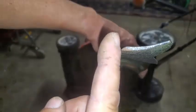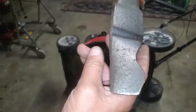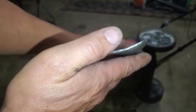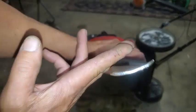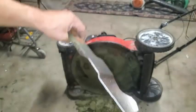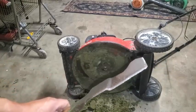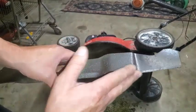You want to try to maintain that angle, seeing it going from this direction. A good thing to do is to flatten it out first — flatten it all the way out to the end of the bevel, just flatten it all the way out until it's straight and flat. You're going to take some material off doing it, and then once you get that flat, you want to try to follow the original angle and create a whole new bevel down to that edge of the flat you just made. I just do this by hand with a grinder. You can get a grinder if you care to sharpen lawnmower blades — Harbor Freight, can't be more than 20 bucks, probably. Get a couple of grinder discs for a few more bucks, five bucks, something like that.